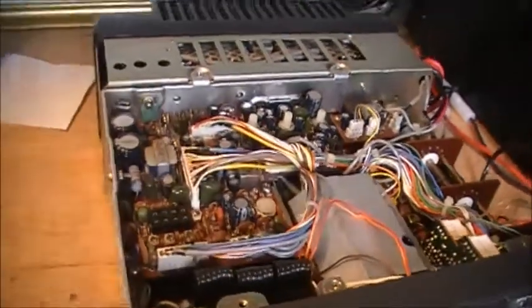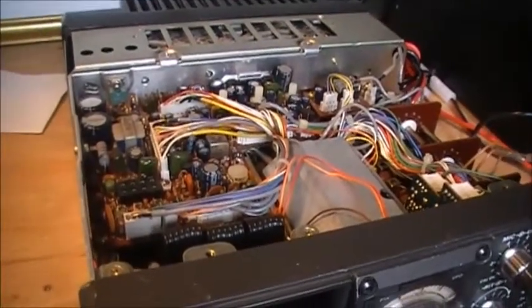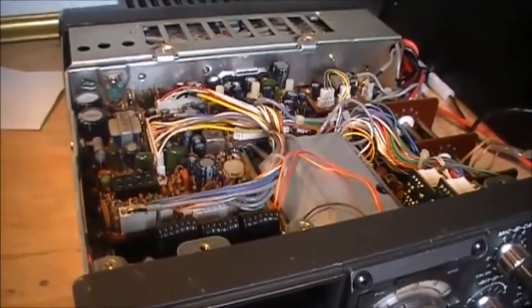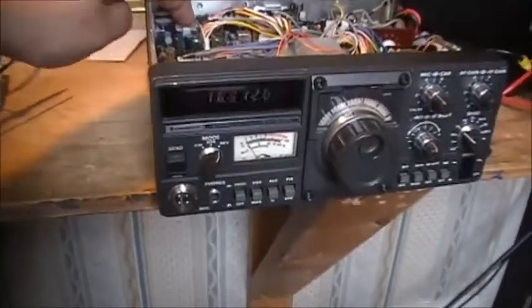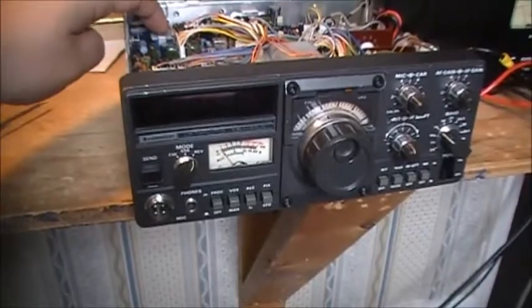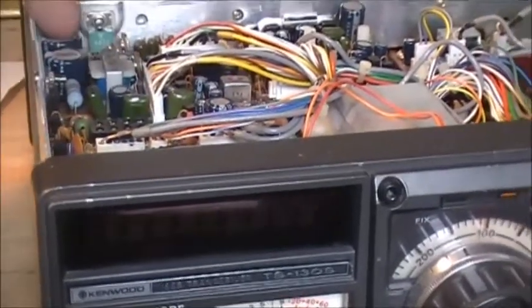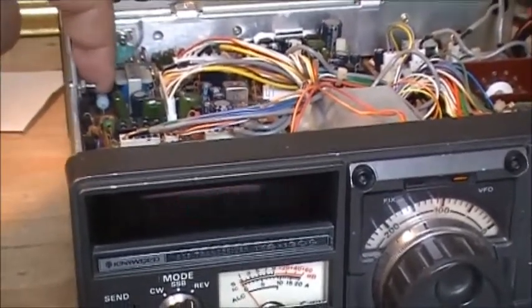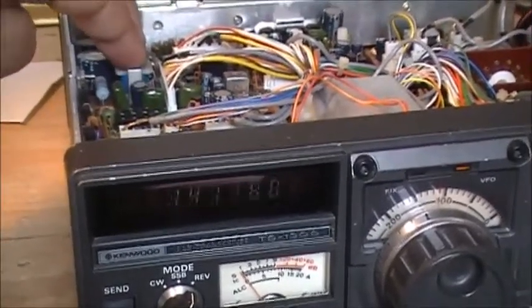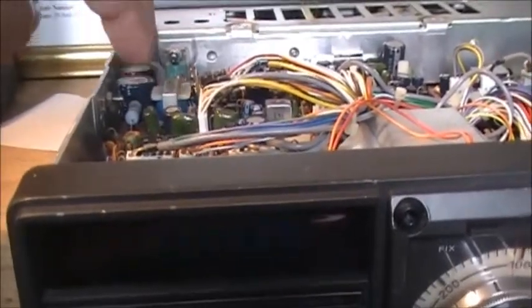It's on this part of the board. So looks like I'm going to have to remove this one again and possibly re-solder that entire circuit board, because it's either a broken trace or a broken solder joint. Pressing on this transformer — not the capacitors, not the resistors at the front — but this part here actually flexes a bit.